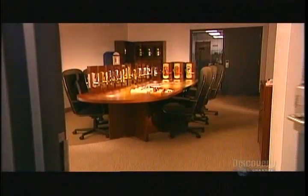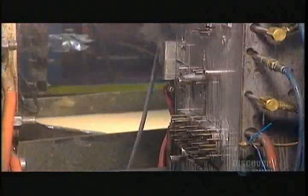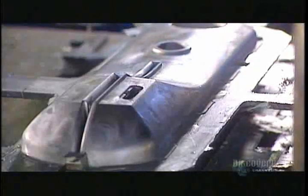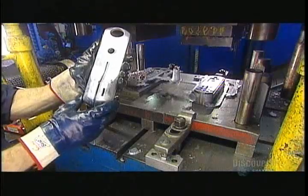The metal case that houses the door lock's mechanical and electronic components is called the housing. To make it, they begin by melting zinc ingots. To melt zinc, you have to heat it to about 390 degrees Celsius. Die casting machinery then injects the molten zinc into molds. Between injections, sprayers coat the empty mold cavities with a release agent, the industrial equivalent of greasing a baking pan. A built-in cooling system hardens the metal, then a trimming die cuts off the excess zinc around each piece and punches in the openings.